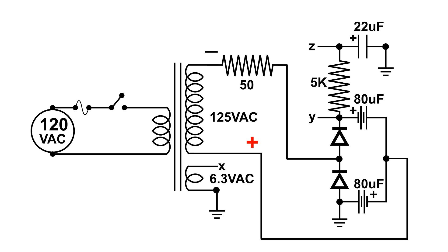Now if we take a look at those two charged capacitors acting as a battery — starting from ground — you can see that we now have two charged capacitors from ground to Y, and they are connected in series, doubling or adding the two voltages together.